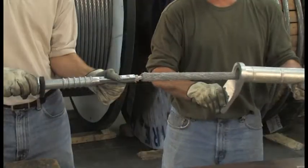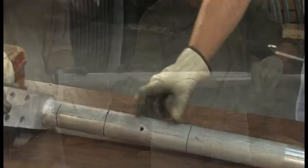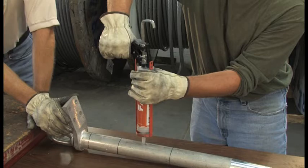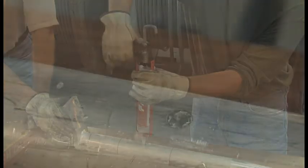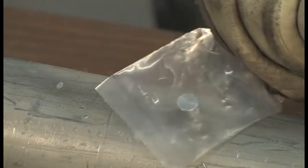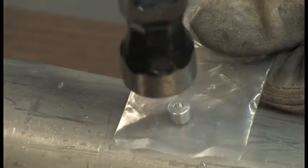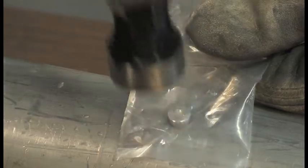Slide the outer sleeve over the forging. Fill the sleeve through the grease port using the required amount of filler compound. Plug the grease port with the plug or pill that came with the dead end. Note: the smooth end without the hole should be inserted into the port and the end with the hole should be up. Use the hammer to secure the plug into the port.